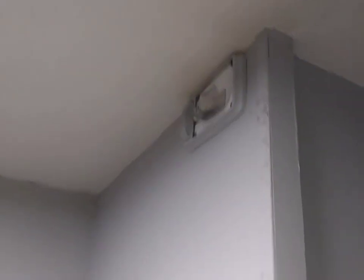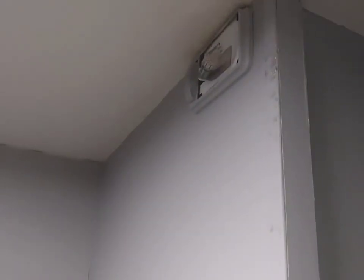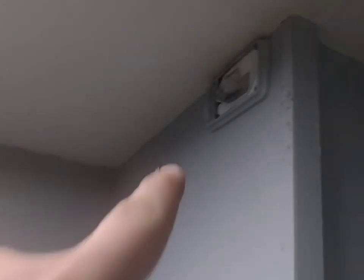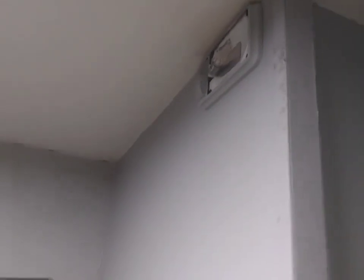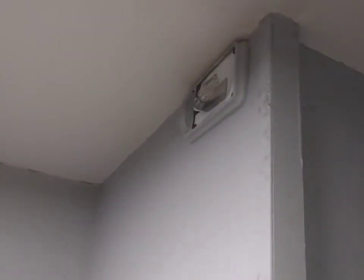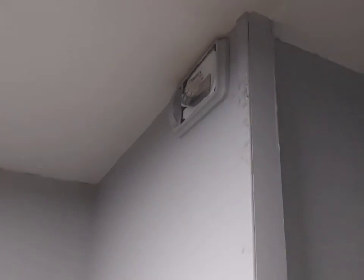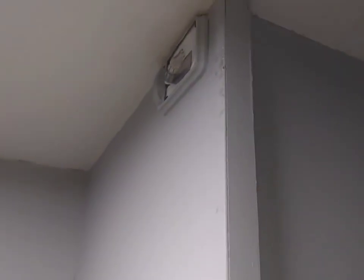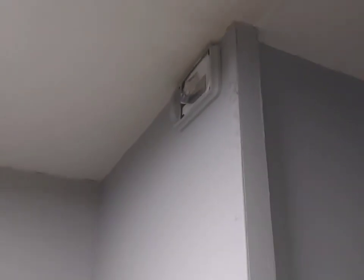And because it has to do that, it takes the 40 watts plus the 5 or 10 watts. So it's not just 5 or 10 watts of power, because it has to use the float charger, and that thing is just inefficient as all get out. 40 watts of power, plus 40, 50 watts of power is what it's taking.